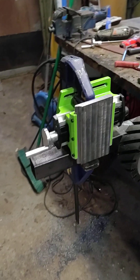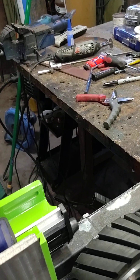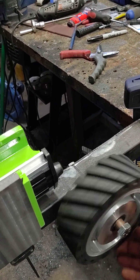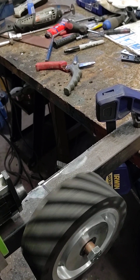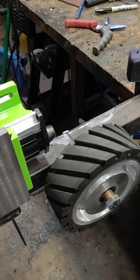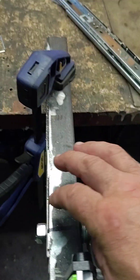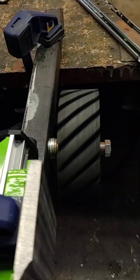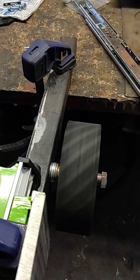Let me show you what I did today — I'm pretty impressed with the progress. I had a piece of square stock that's going to be the arm. I bought a six-inch wheel off Amazon that cost me all of fourteen dollars. I lined it up yesterday so it's going to spin good. I put spacers and bushings, tack welded a nut on there so it doesn't move. I ran it for two hours with a belt on it — didn't get hot or nothing. As you can see, it spins pretty free.